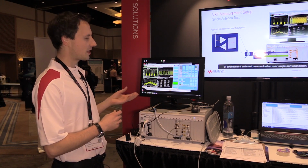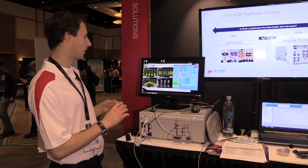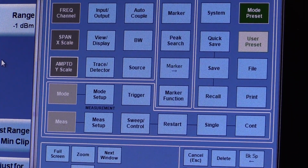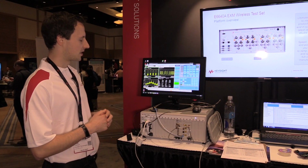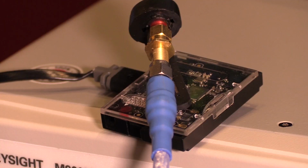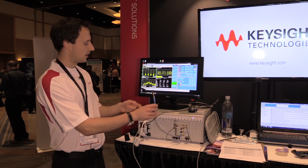And so what we're doing is we're testing the ability of that device to transmit the signal, to not pollute adjacent channels, to have a very clean transmission, and for our access point to be able to recognize that signal and really just be able to capture that data and get the data that we're trying to transmit. So what I'm showing here is Bluetooth Low Energy. What I have is a script I'm running that allows me to send Bluetooth Low Energy packets from this Texas Instruments device.